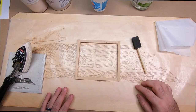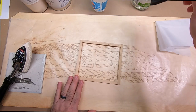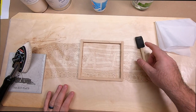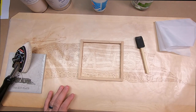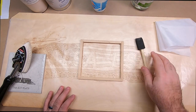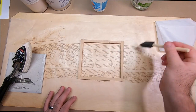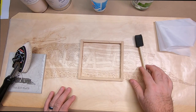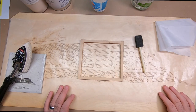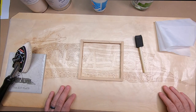Next thing you're going to want to make sure that you have on hand is some water. As soon as you brush your last brush stroke, you're going to want to put your brush directly in the water. We did ruin a brush in testing this because we used a regular brush, first of all, and secondly, the Eco Bond actually changes and becomes really not water soluble if it has a chance to dry at all. So as soon as you make your last brush stroke, if you go right in the water, that maintains it, and you should be able to get that cleaned out of your brush by just using water. The Stewart system with the Eco Bond and the Eco Fill are water soluble, and they are almost zero odor.